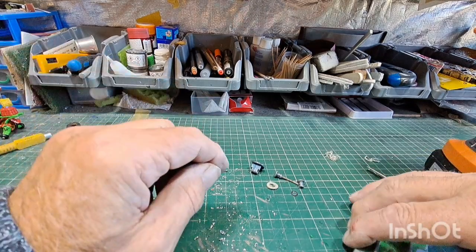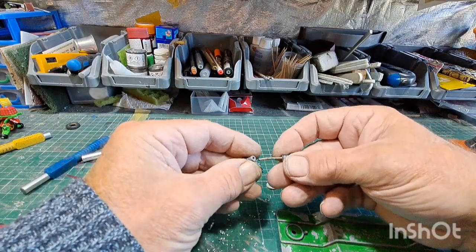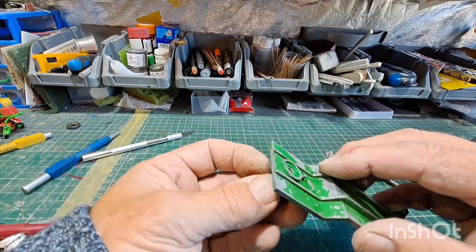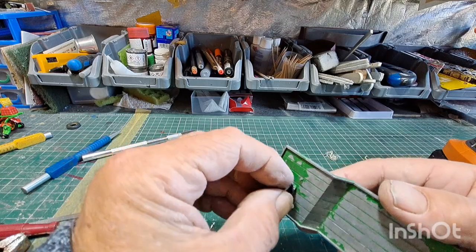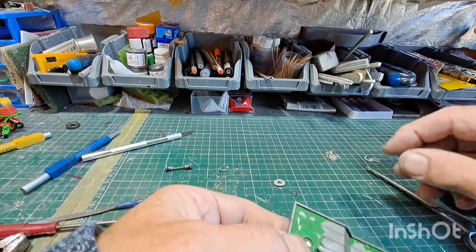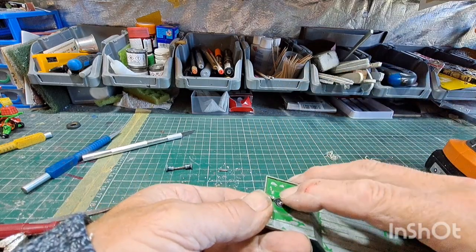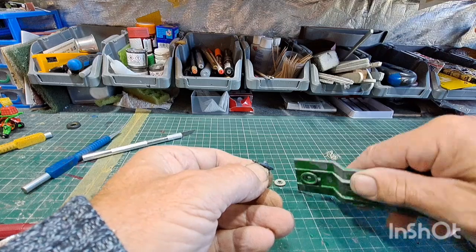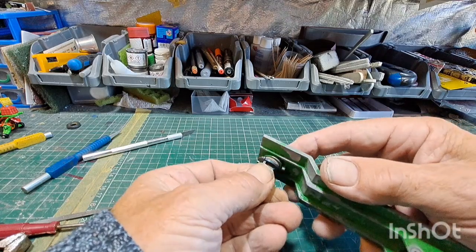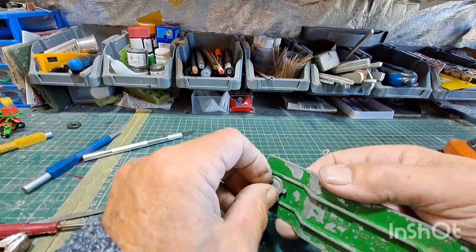Right, got it apart. Quite straightforward. Let's get this all back together again. Yeah, just drill through the top. Just a little bit. Not a lot. Yeah, just drilled that through the top, and there was that washer on there. So I just drilled a bit through the top, got the screwdriver and it popped straight out. And what is underneath is a felt washer. So that goes up underneath there. That helps it obviously to smooth operation, so I mustn't lose that.